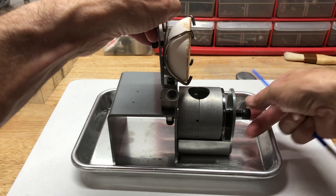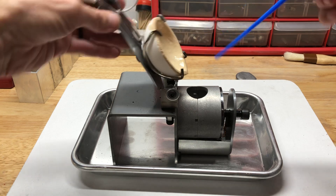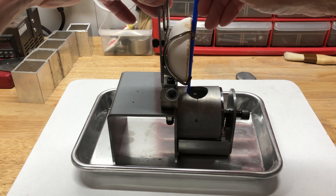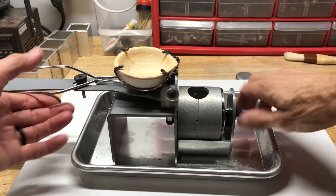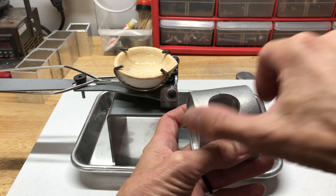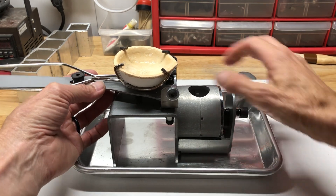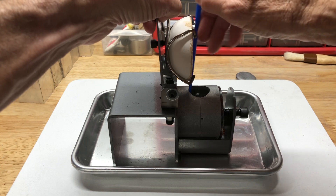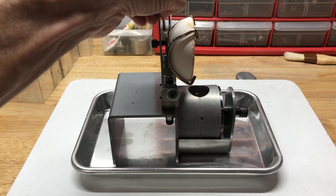What I realized is that it's really important that the edge of the crucible line up with the inside of the flask hole. Now say you have one of these handles that is a little bit bent and stands out a little bit. My flask design has a wide side and a narrow side — you can literally just turn it over and it will change the position of that hole. So if the crucible is standing out a little bit, you now have the edge of the crucible and the inside edge of the hole lined up, and you're going to have a good pour.